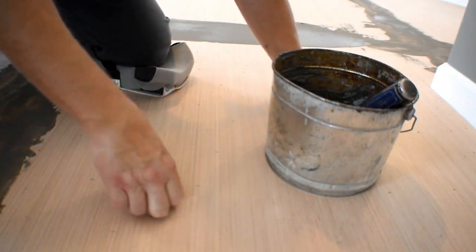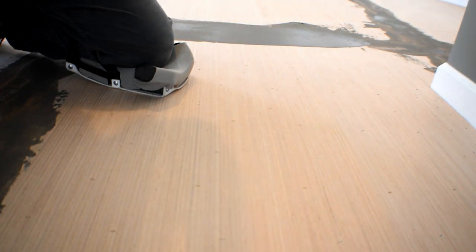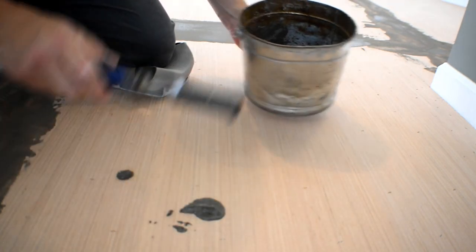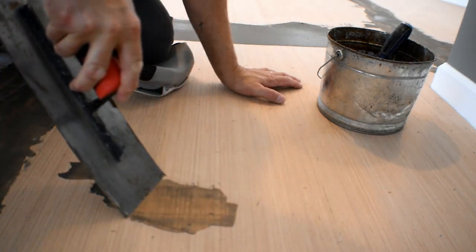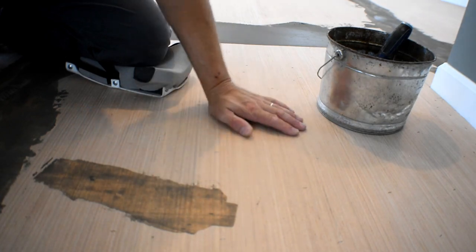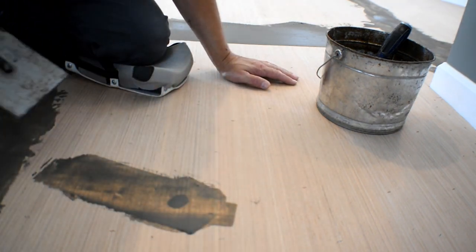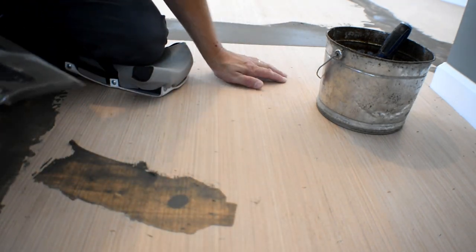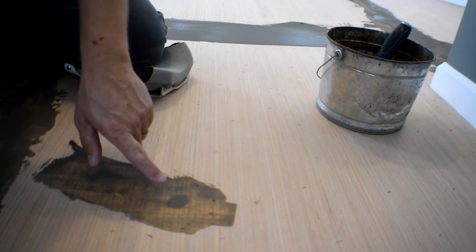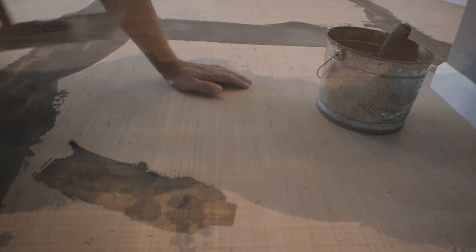I just wanted to show really fast while I was in the middle of mudding here — you guys hear me say don't beat your staples down. I want to show you why that's important. See that? It virtually takes every bit of it right back up. Now watch — say there's a staple right there and I had to beat it down. To the eye you can't see nothing, but now watch — see that? Now there's a dip in the board which allowed that mud to stay there. So if you're working with a shiny vinyl and you beat your whole floor up like that, you're going to have to go over the whole floor and take care of all of those dips. That's why I stress it: don't beat your nails down — sand them off.